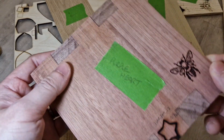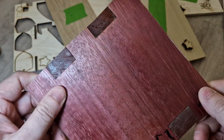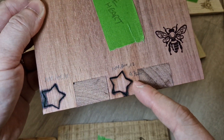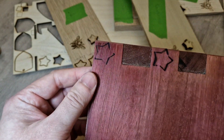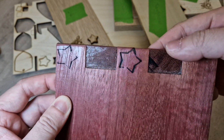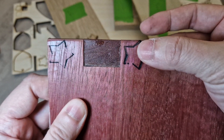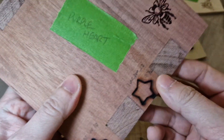The next three are not so successful tests. First one is Purple Heart. This piece of wood is really hard. I did 10 passes and then 12 passes on a 4.7 millimeter piece — I call it an OK result. There's a tiny bit still connected here, but everywhere else is cut through fully. I can use a sharp knife just to cut it here to remove the piece.